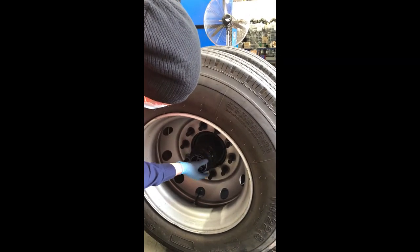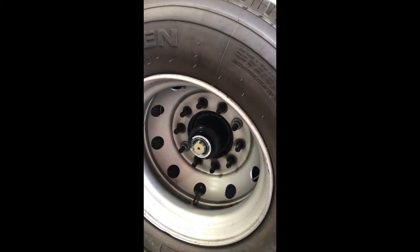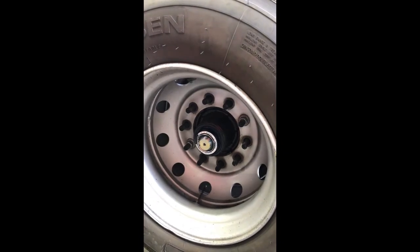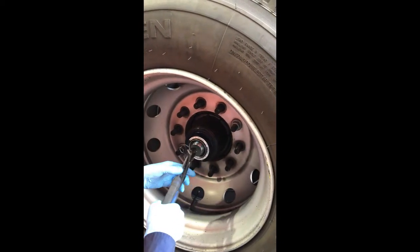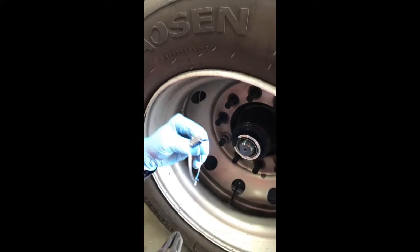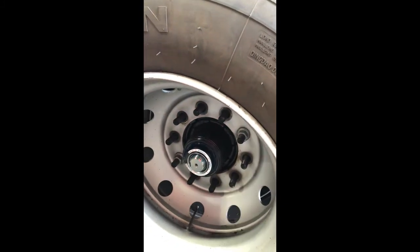To remove the Eco Plus 3 hub, remove the hubcap with the correct hubcap socket and disconnect the lock ring and remove the retaining block. Store the wedge block and the locking ring in the hubcap to keep it clean for reuse later.